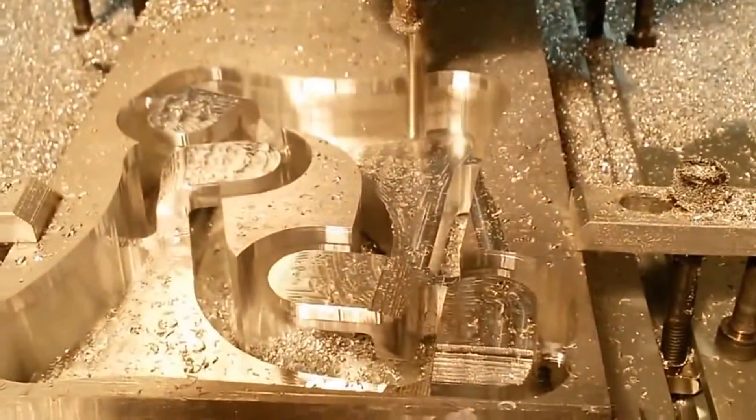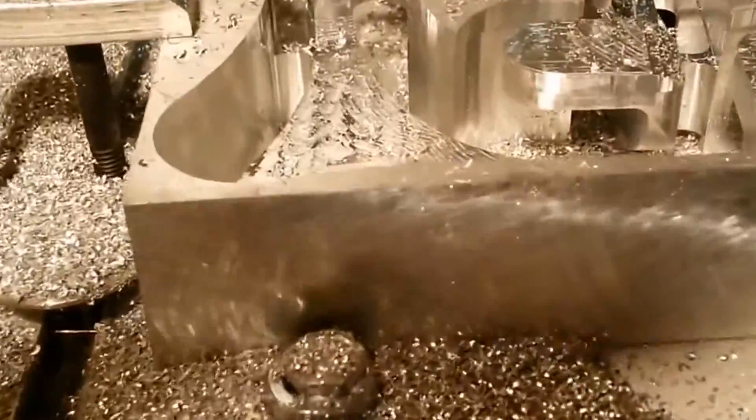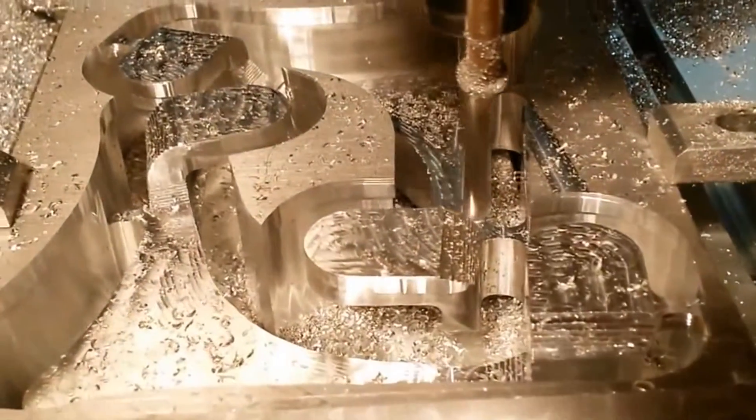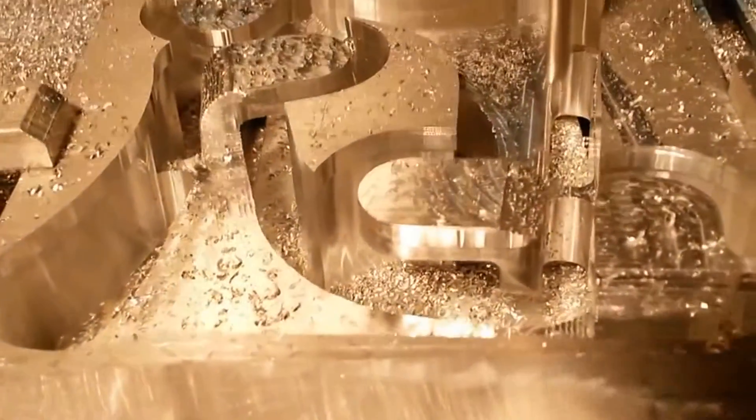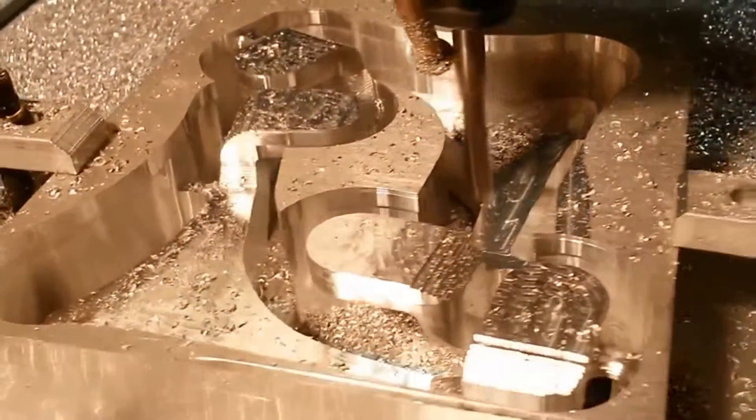This is a roughing task on the back side of these brackets. You can see that the brackets are, for a large part, hanging out in space — they've been attached to these little screws there. I'm picking off half a millimeter cut and one millimeter side to side.